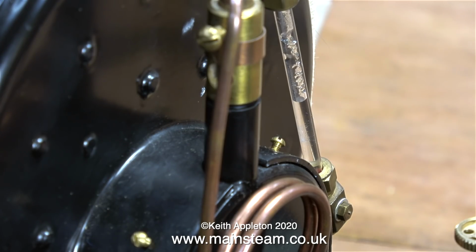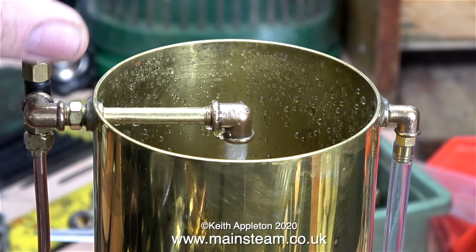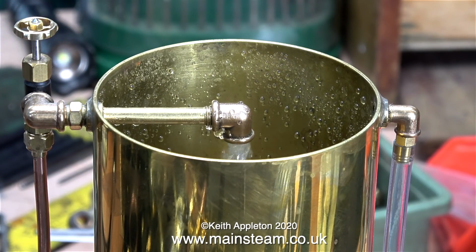The only problem with compressed air running a steam plant that was designed to run on steam is lubrication of the cylinders. The water cylinder lubrication is fine. That's done by the water that courses through the pump. But the steam cylinder end of the pump will probably be quite worn by now because it's been run dry.